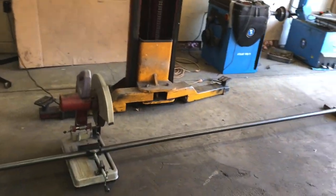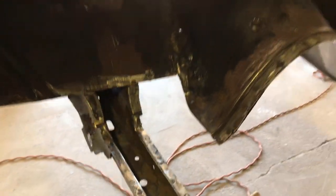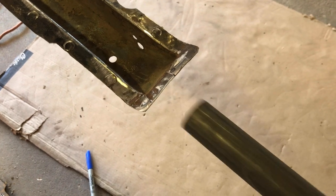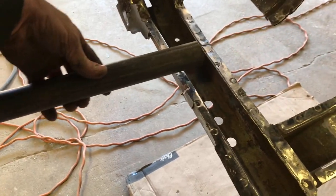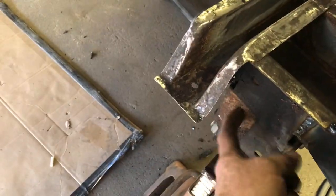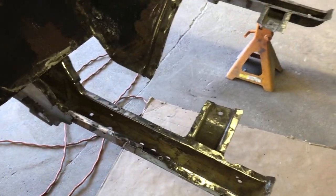Meanwhile we're gonna make our first cut. Got the machine all ready to go here. The plan is to go up into the frame rail — we're gonna notch the back of the frame rail so that the tube goes through it, and notch the side of it so another tube goes across. This is gonna get welded to there, that's gonna get welded to there, it's gonna come back like this and cut in into that plate right there. That's the plan — see how it works out.